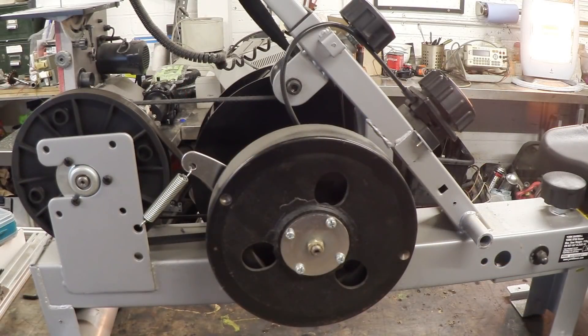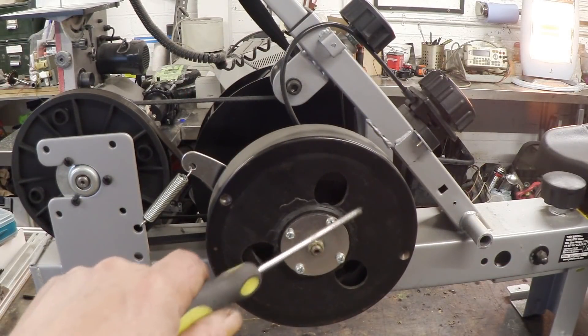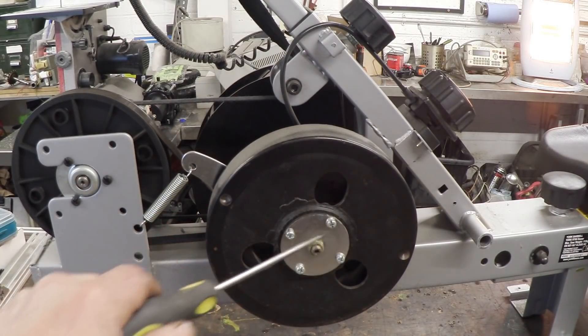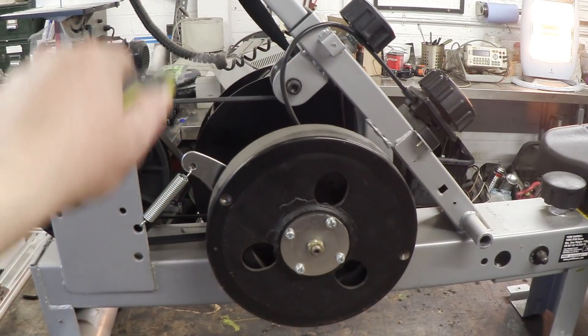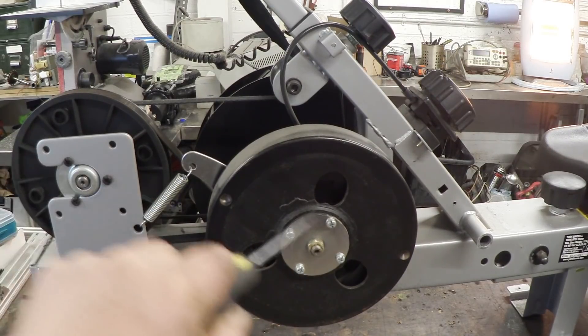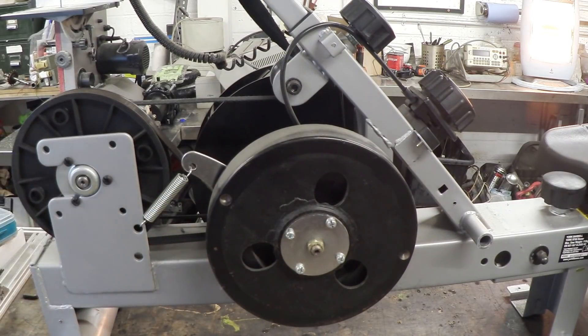Here's the left hand side with the covers removed. That's clearly a flywheel; there's a tension adjustment here going to the back of the flywheel, so I'm guessing some kind of magnet arrangement maybe. That's the pull strap that's attached to the handlebars there, comes behind there — operates this large pulley with a belt on it, there's a belt tensioner going to the small pulley, so that's where we get our gear ratio right there.